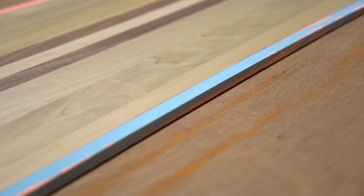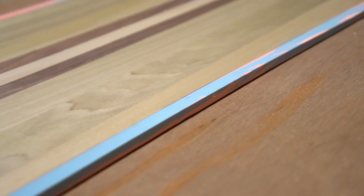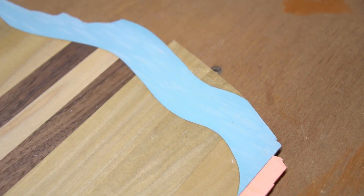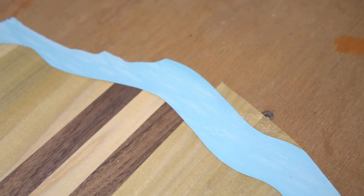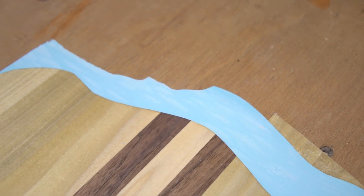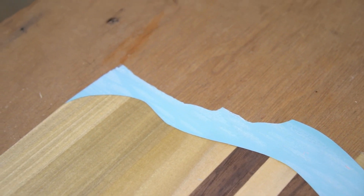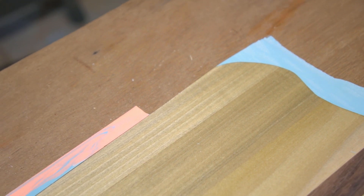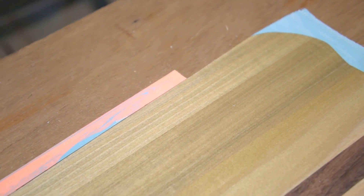The original plan was to wrap poured urethane sidewalls around the core. I ended up doing a combination of pouring the protection for the nose and tail, and gluing the sidewalls on the sides of the board in place. But when I went to profile the core, I ran into some issues. Long story short, I didn't leave enough stock on my tip or tail to account for sniping in the planer, and I didn't fix them down firmly enough, so my urethane blew out. So I'm going to be changing tack to a different technique.